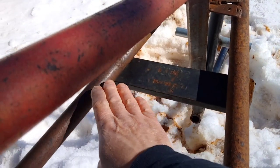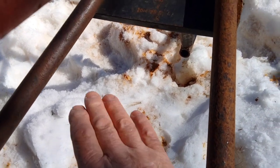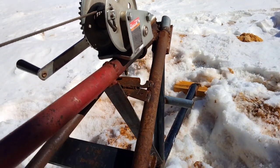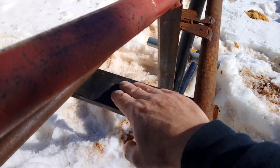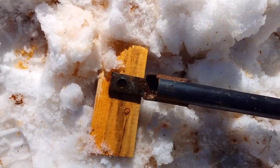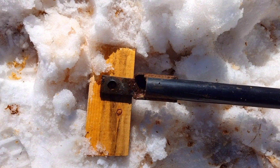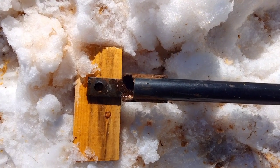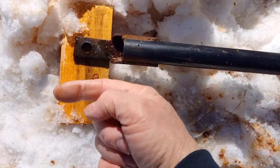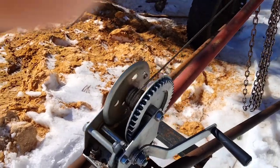On the tongue I added a brace and welded it on — this keeps the pipes from spreading when a log sits tight in the arch. We've had problems there and done multiple welds, so this brace really works well. The tongue hitch is just a 5/8-inch hole through a piece of flat bar that sits on a bolt-type hitch on the back of the four-wheeler or tractor draw bar. You can put a nut on the bolt or drill a hole through it and use a pin to keep it from coming loose. The winch is held on with U-bolts — pretty straightforward.